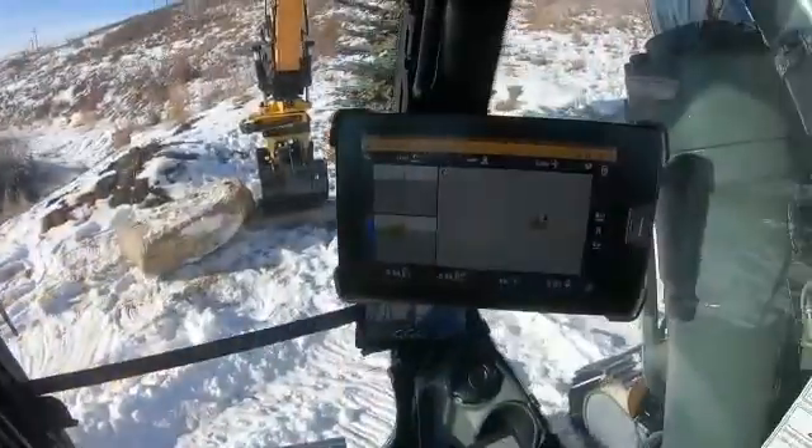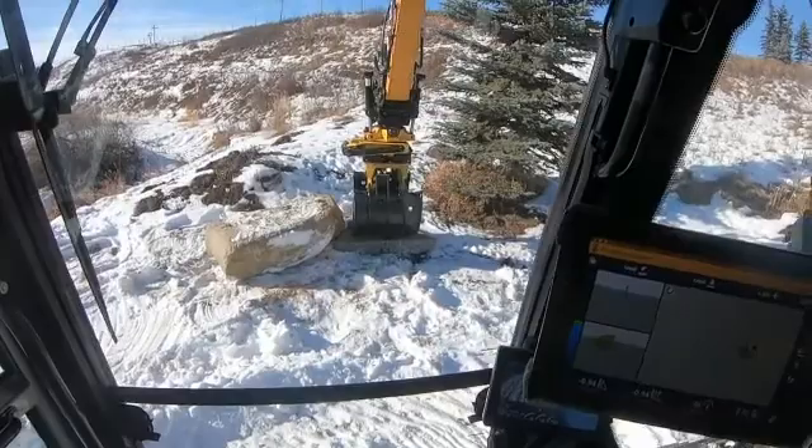With a 2D system like this you're basically replacing your grade man. We figure we're about 30% faster when it comes to basement excavations or excavating for tanks and septic systems — if you do the math, you can see it's going to pay for itself pretty quickly. But on top of that, the main thing we realize is the safety factor. If we're digging a septic tank hole 17 feet deep, nobody wants to go down there and hold a shot rod. It's great to have a system where we don't have to put people down in a ditch or hole where there's a chance of collapse — having less people around the machine is obviously way better.